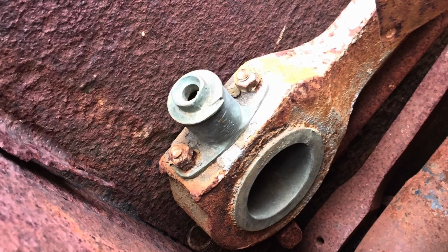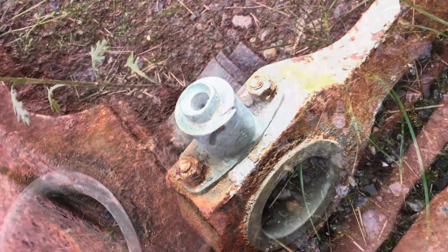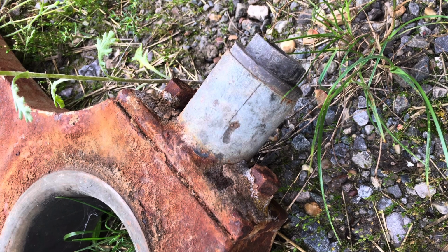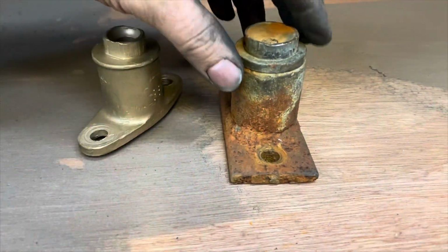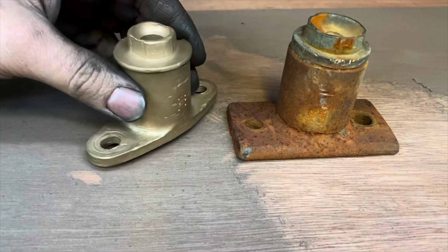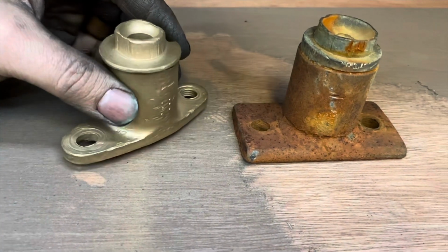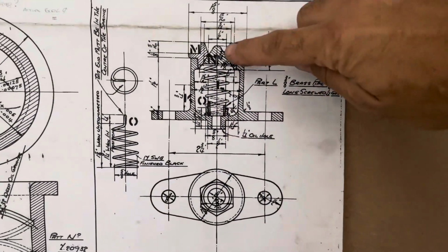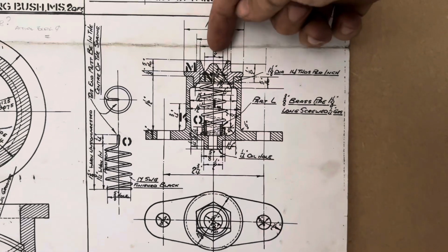We had one, this was it. The rest, where they were there, was a Tully modification like this, which is just a steel tube fabrication. We cleaned the original one up, as you can see, but we'd only had the one, so we decided to make a brand new batch of them to the original works drawings so that they'd all be matching on the loco. This is those drawings, and you can see there's a brass cone at the top.